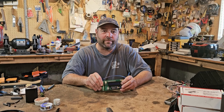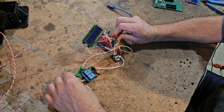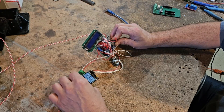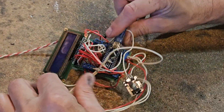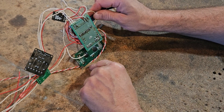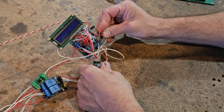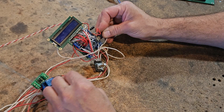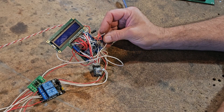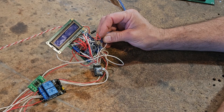Here's the actual THC that we've been using on our machine for quite some time. It's kind of a crude looking device, but what happens when you do electronic development is you have to start out with what's called a perf board. It's just a circuit board with a number of different holes in it that lets you attach components, so you have to run your own wires as traces and hook up components like encoders, opto isolators, relays, displays, Arduinos, capacitors — all that type of stuff manually. It does work, but this is going to be difficult for people to deal with.